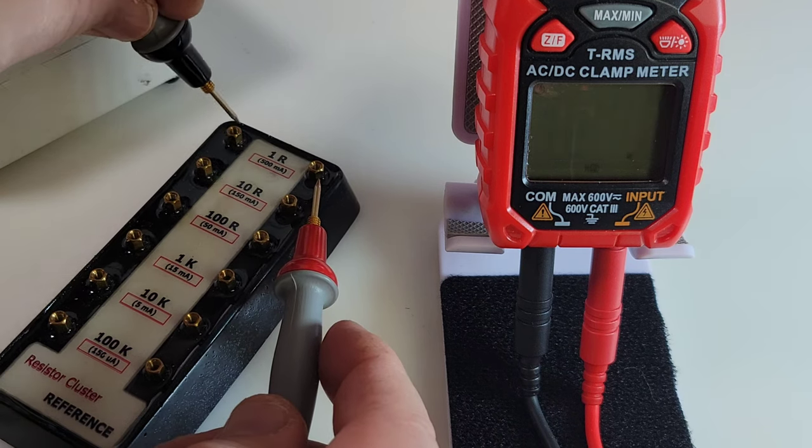Sitting at just over 32 volts right now on DC voltage. Bringing it down — 21.53 reading as 21.4. Down to 14.3 volts, coming up as 14.37. Down to 6.58, reading 6.58 — nice. Then 1.12, reading 1.128. When you are in high voltage, even at 30 volts, you're not getting a high voltage alert — that's kind of too bad. But accuracy-wise it seems pretty decent.